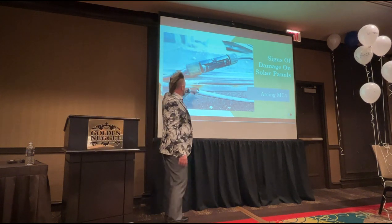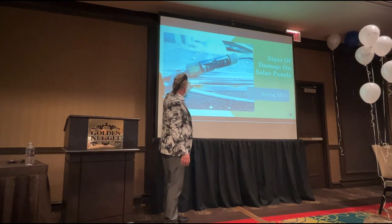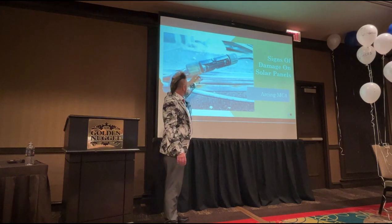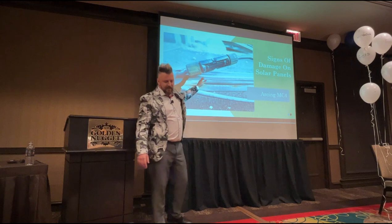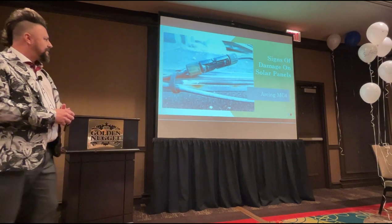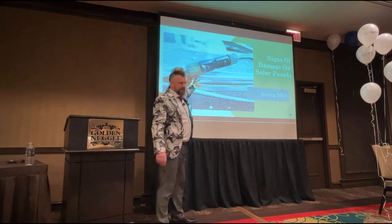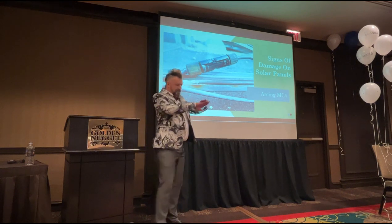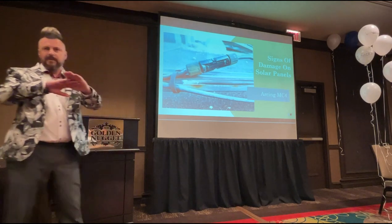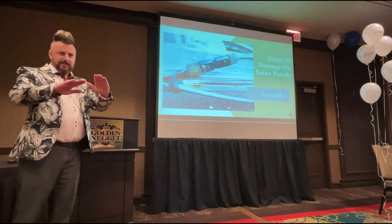It's arcing. How do we know that it's arcing? Because you've got this brown mark here and you've got the white and the brown there. So when it's raining, it's causing this electricity to jump. If that carries on doing that, that MC4 is going to melt and it's going to start a fire. So, arcing MC4s. MC4 connectors are not supposed to be exposed to the weather, the rain specifically. They're supposed to be covered. They're not a watertight, waterproof connector, so they should always be tucked up off panels, underneath the panels and off roofs. They shouldn't be resting on the roof either.